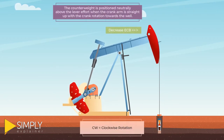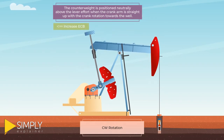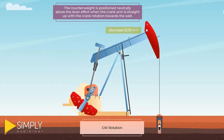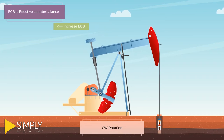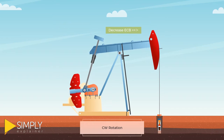Mechanically and continuously and favorably repositioning the counterweight either away from the load and fulcrum, thereby increasing the counterbalance effect, or nearer to the load and fulcrum, thereby decreasing the counterbalance effect. The extended counterweight is swayed away from the fulcrum to increase the counterbalance effect, and swayed nearer the fulcrum to reduce the effect.